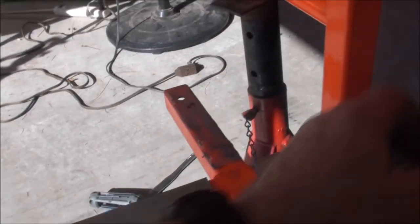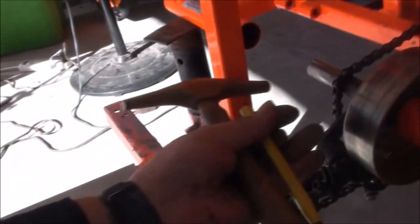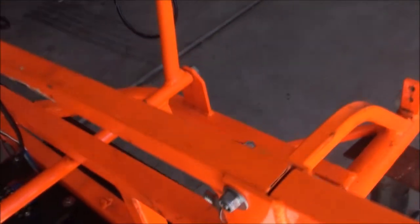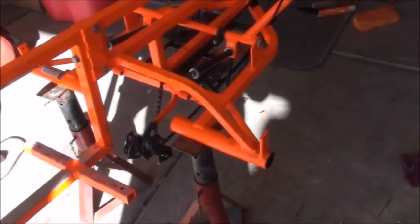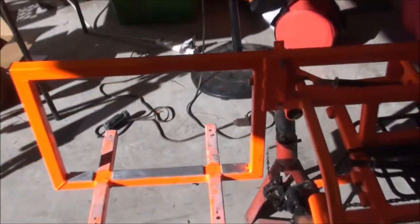I filed down the Allen. It's a good idea to take a punch and tap the keyway so it doesn't slide with the hub. The right axle is all out. Now the last things left are to find the master link, pull the chain, and remove the derailleur.